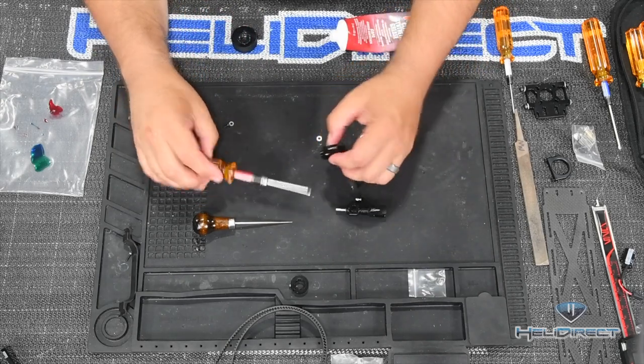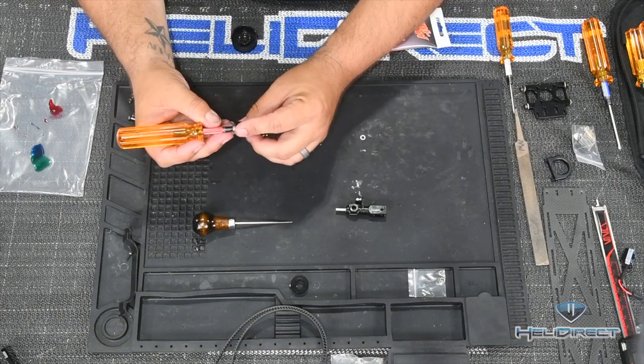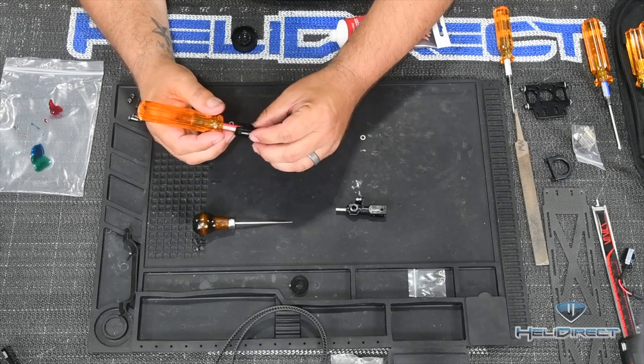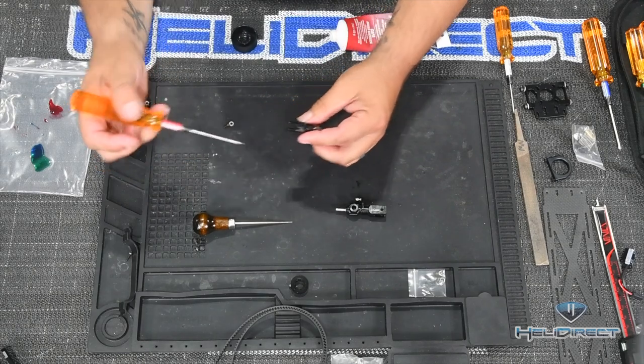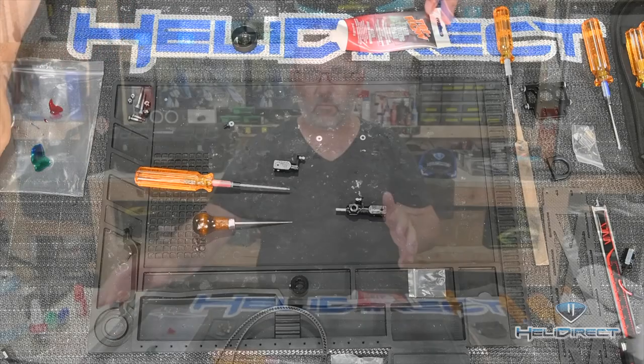Here's another thing. As I slide this into here, I'm going to pack that in again and then take the driver out. It's also completely okay if, as you're building a main rotor or a tail rotor, the first time you try and spin it, you feel friction. It doesn't feel good. It doesn't feel smooth. It feels notchy. Don't ever be afraid to take these apart and rebuild it. It may be you did nothing wrong, that everything's in the right order and you did everything correctly, but sometimes things get unseated or a little funky. It never hurts to pull it all apart and triple check everything. Maybe you find something, maybe you don't. Sometimes the act of just taking it apart and putting it back together again fixes whatever little tiny thing was slightly out of alignment.